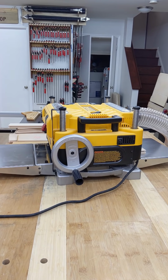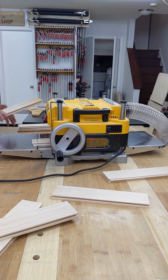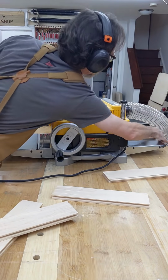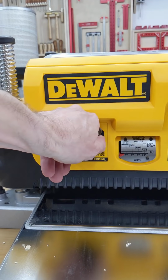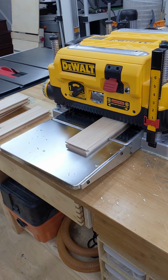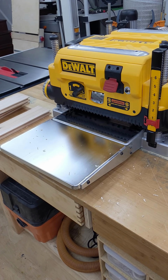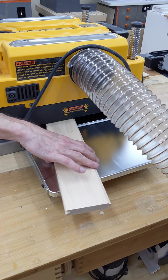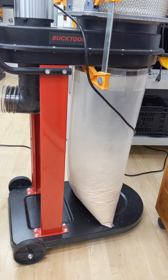I used a planer to remove the grooves from the bottom side. First coarse planing, then fine, to obtain a nice smooth finish. My material was a bit under 3/4 of an inch after this operation. You can use thicker or even thinner material for this build, depending on who is gonna sit on this stool. Look at all those shavings dancing in my dust collector.